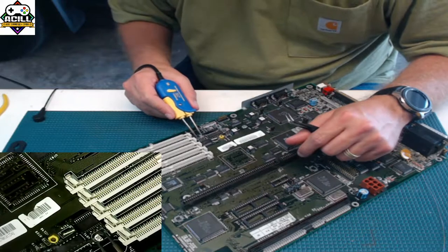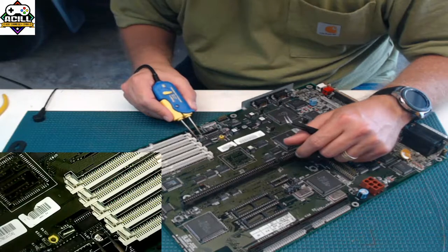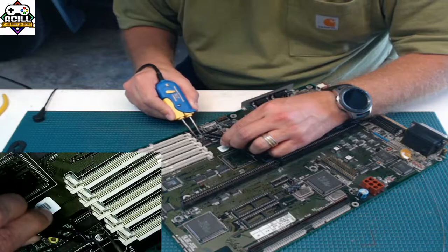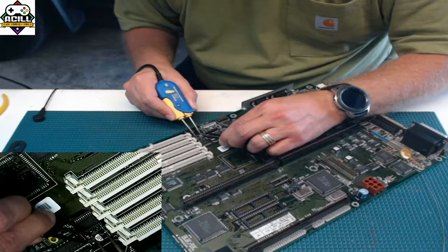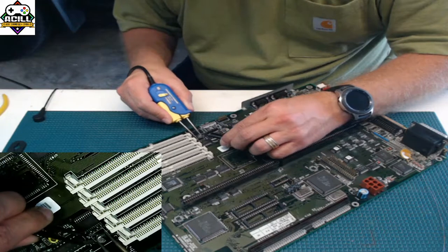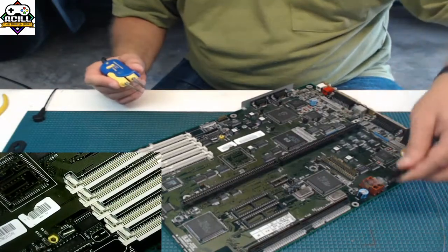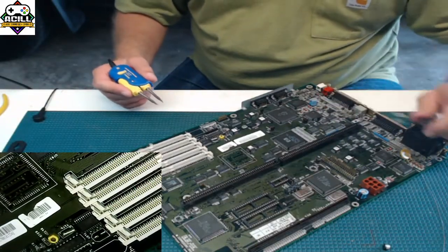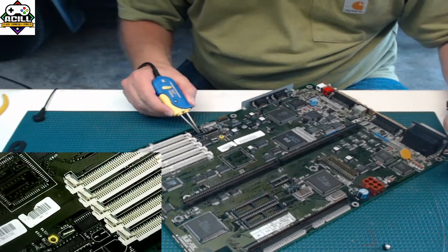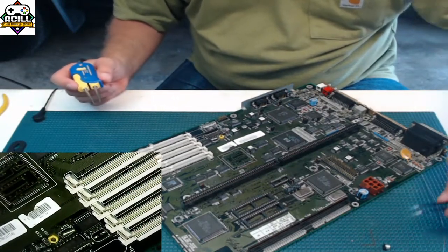Here's the parallel removers. You're going to put them on both sides. Just enough. And when it's ready to come off, it will come off very easily. There you go. Simple, nice and clean. And you'll notice another thing too. You can see how nice those solder pads look underneath. They aren't mangled or gross or nasty. They're nice and clean. That's the magic of the flux.